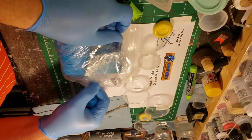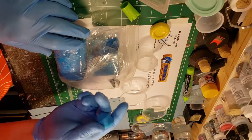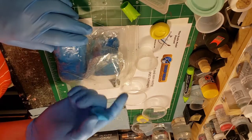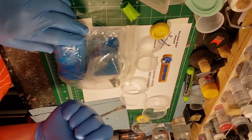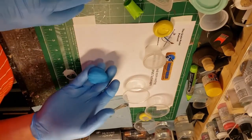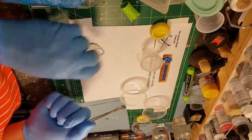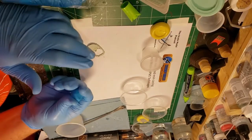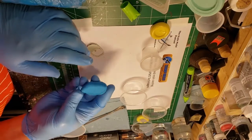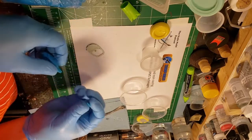This stuff is a molding clay. A lot of standard modeling clays have a sulfur content that interferes with the molding rubber, so this was made specifically for building two-part molds. You'll hear someone say 'claying it up' — that's what this is. You lay the part in and make it really nice. You can buy this wherever you buy the mold materials. You don't absolutely need it — there are other materials that work — but I tried mounting tape and the silicone in the adhesive or tape bonded to the silicone rubber and it was a disaster, so don't do that.